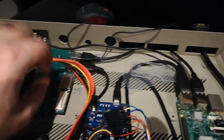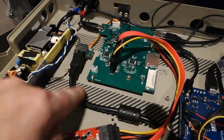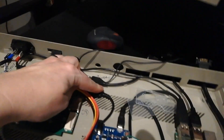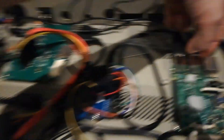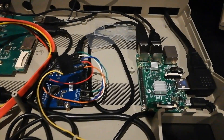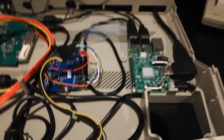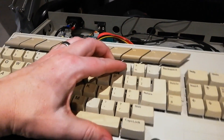There's another USB here going to the USB out of this device — it doesn't work as well as I hoped. This device has power coming to it via a SATA cable with power. One powers the Pi, one is the external USB as mentioned, so we do have one USB free. And being a Raspberry Pi 3 it has Wi-Fi, so the whole device is internet-updatable and FTP-able — that's the project I've been working on for the last few months.